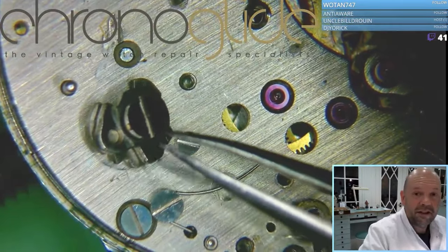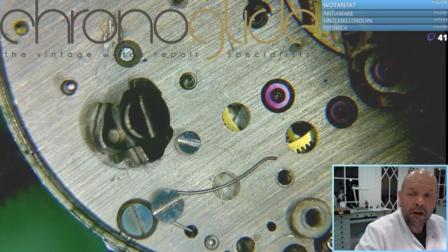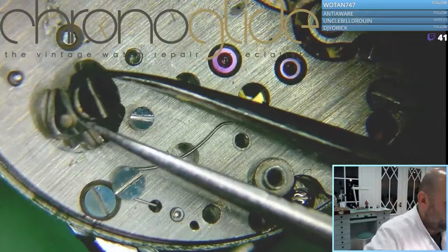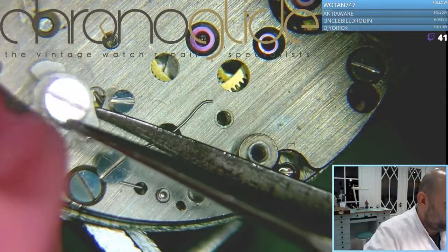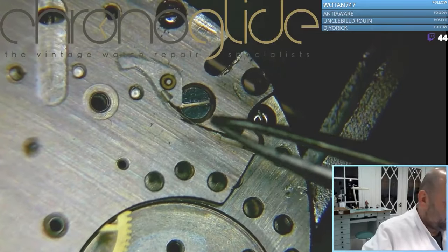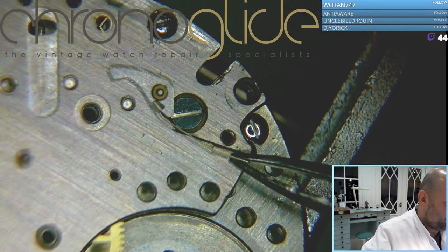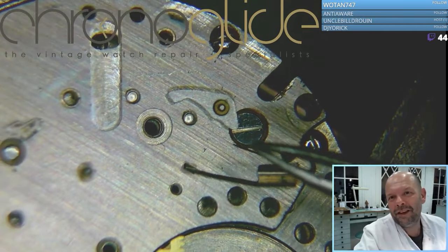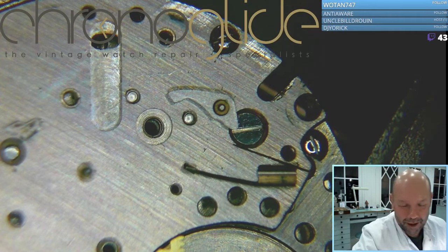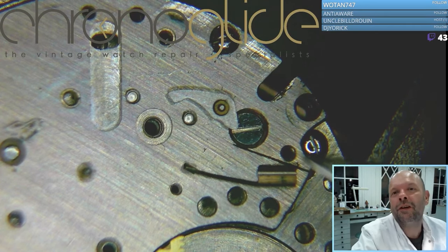You can imagine there's a small shoulder in this screw, otherwise it will push the cam downwards and you won't be able to move it. There are a lot of special parts in a chronograph. You can see here's a slit in the plate and that's housing this spring. If I remove this one — for me this is Le Mania.